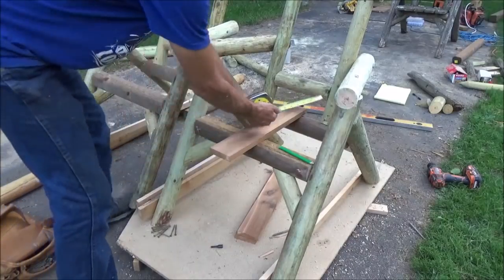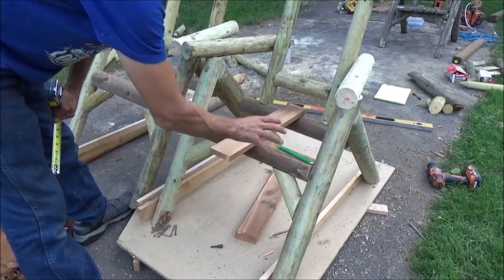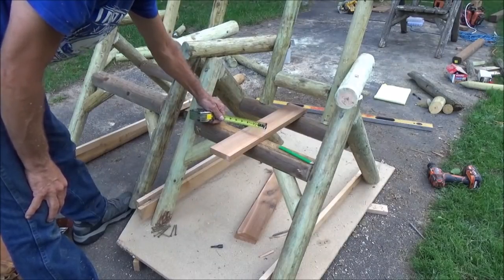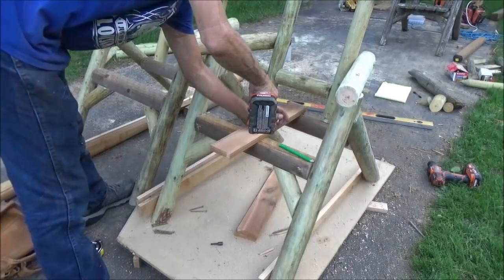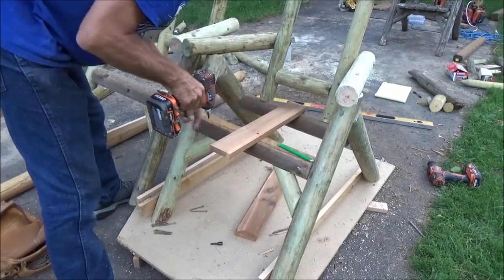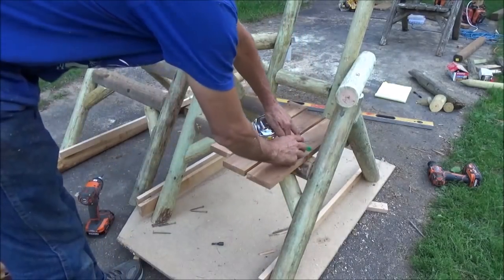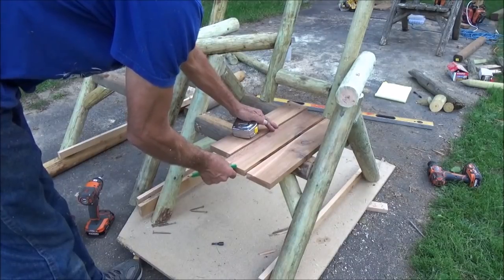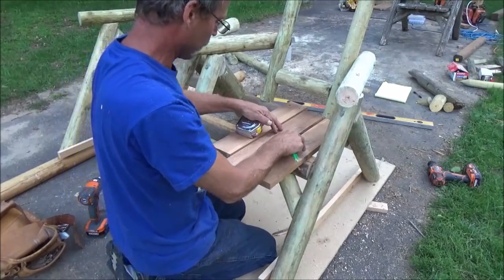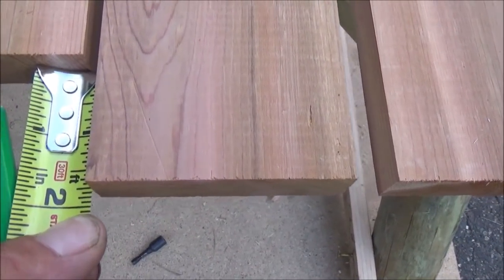I end up with exactly five and a half inches, and I'm exactly on in the back. I centered this, which ended up being eight and three sixteenths. I said three and three eighths, which is what I ripped this down to, which is what was on the other chair. You can buy one by four cedar that's already three and a half inches — you could easily make that work in here. I set mine in three quarters of an inch right here. The gap still looks the same as the other chair — normally I would like a smaller gap, but this is what the other one is and we're trying to copy it. I have to cut a notch around that back upright right there, so I need to take out an inch and seven eighths.